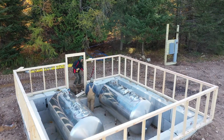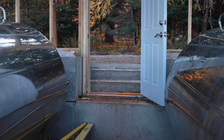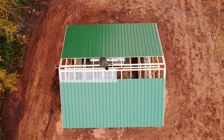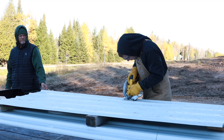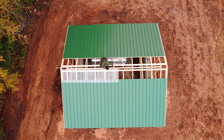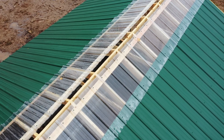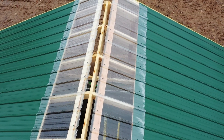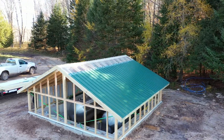We went back to Bickler's and picked up a set of off-color or cracked stairs — they were kind enough to donate us a really nice set — so we got those concrete steps going down into the sap house. We wanted to represent Sparty and make this a showcase, so we went with white sidewalls and a green roof, not only to represent MSU but also strategically so it would melt and shed snow. Since sap houses are almost always fairly dark, we used two feet of skylights right along the ridge, letting in a ton of natural light and ventilating the building. We didn't close it in tight or insulate it — we wanted it to stay cool during the spring so the sap didn't heat up in the tanks.